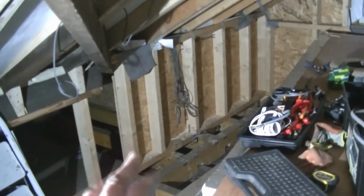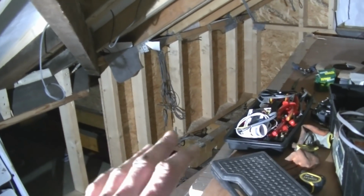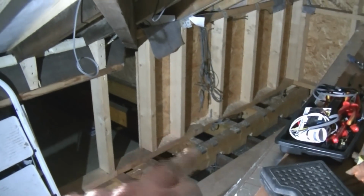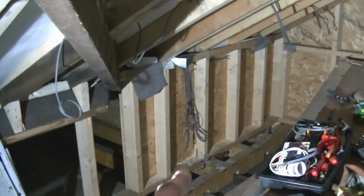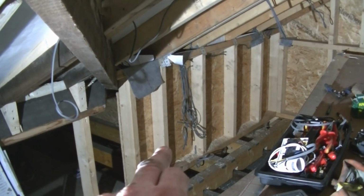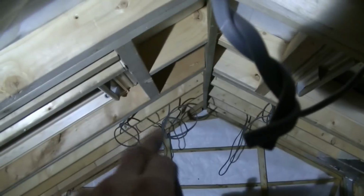One other thing I forgot to mention, I just remembered last minute, is my smoke alarm. Now I've got a smoke alarm downstairs which is already linked to the mains, and another smoke alarm down on the ground floor. You can't quite see it here because it's just down there by the joist, but there are the wires for the smoke alarm, which is just below us on the landing, or the downstairs ceiling there. So what I've done is just roughly put the 3-core and earth in, which is what you need for the mains powered smoke alarms, and I've run that up there, and you can see that's one of the cables hanging down up there. That's what it's going to be up on my ceiling.